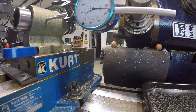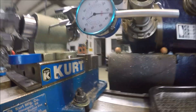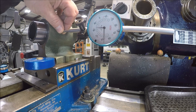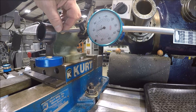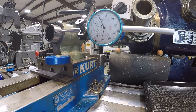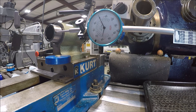Moving to the back of it - the camera's probably going to wash out, let me move you back. Let me try this - I can see a little better. Moving the indicator carefully so it doesn't go ka-plunk. Now we're on the back side and we're at zero. So we've got a machined face that's true front to back to work off of - obviously they just didn't bother to machine the sides.